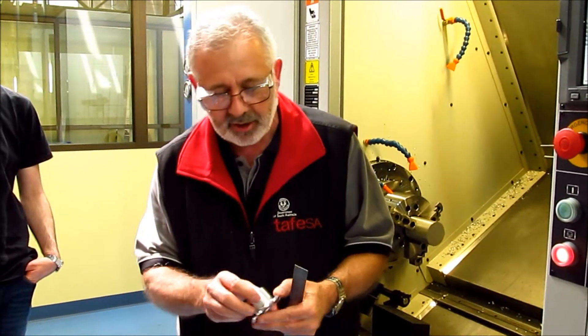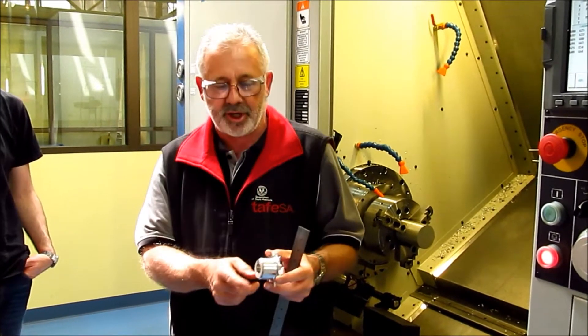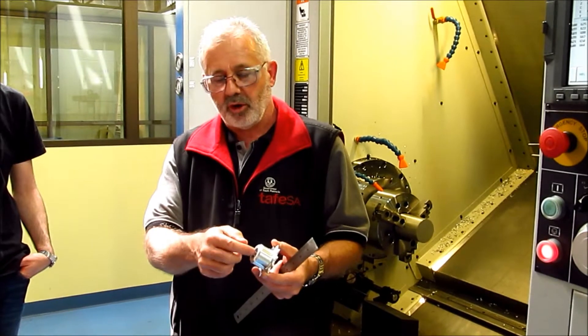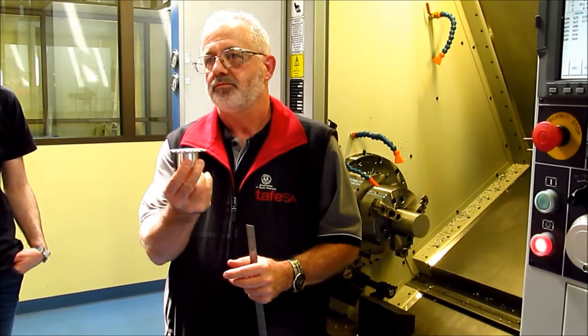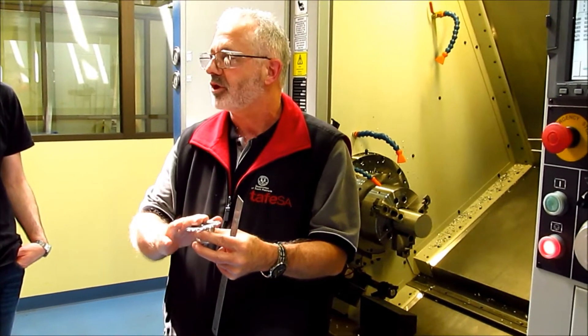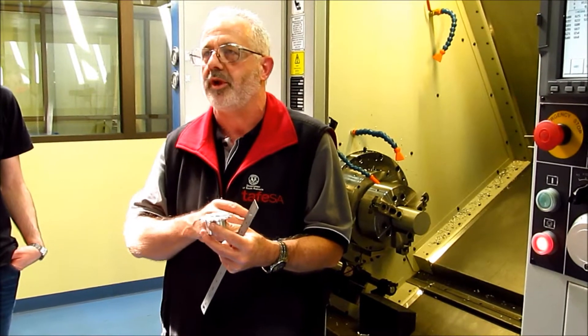This takes a couple of minutes, and in a conventional workshop without this multi-axis machine you'd have to turn this side of it in the lathe, drill the hole on another machine, mill the side on a milling machine, then contour this round on the mill, and then do all the chamfering and finishing on the other side — so three processes maybe, or you could do it all on the mill depending on what you're doing.